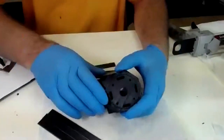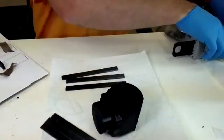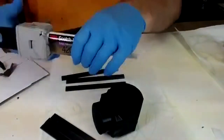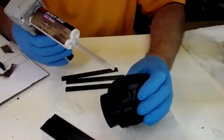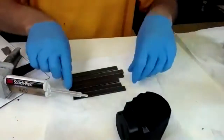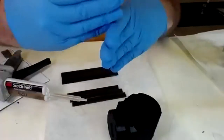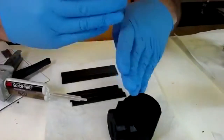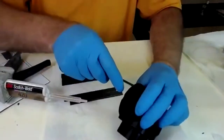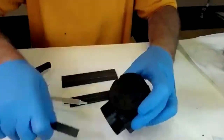And you need to do all 6 strakes at once because they're inside, they're going to connect. I'm using our epoxy gluer. We sent those kit ones out. And again, just to make sure, got my short, my longs. You've got the intersection where those carbon fiber strakes sticking in there actually touch each other. We want that carbon fiber on carbon fiber. And we're not using that one, so I'm going to start with these 3.